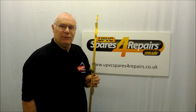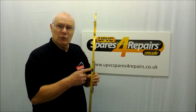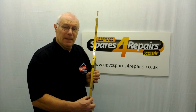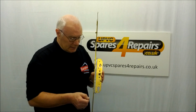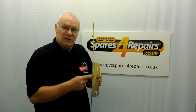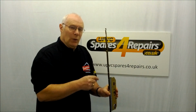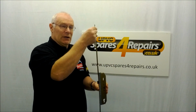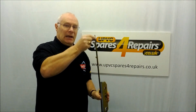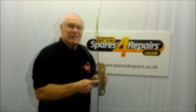We assume that we have discovered that it is certainly a Mila lock. The logo is usually on the faceplate, the 16mm wide faceplate. The centre box is removed by 3 screws being removed, and this is the same for both the full length lock as well as this type, which has got a section which goes below and a section which goes above. But the centre box, the exchange of it is exactly the same.